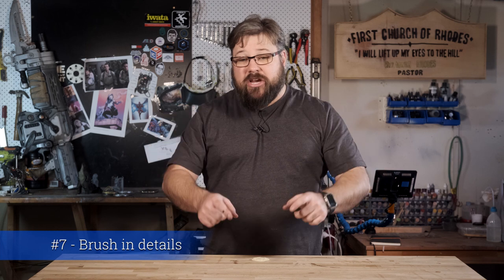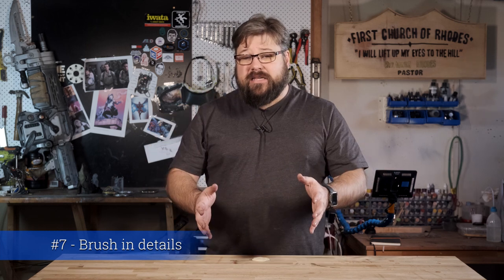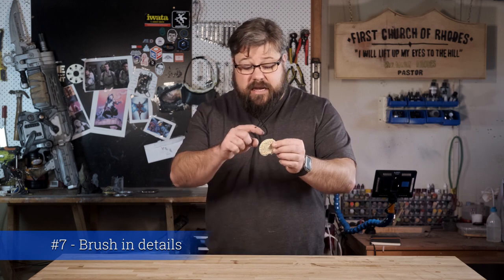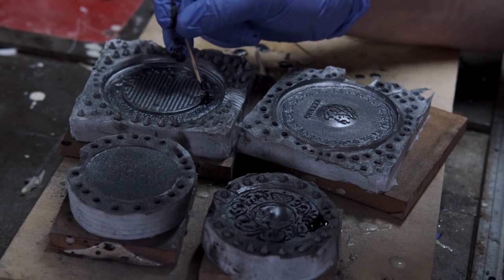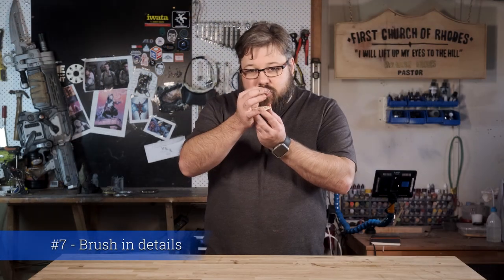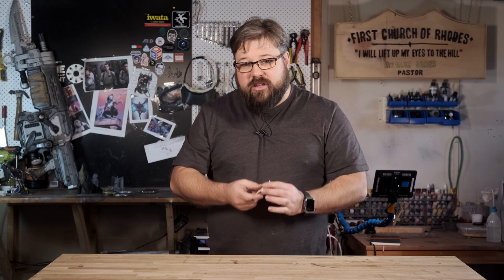Tip number seven is brush in your undercuts and rotate during filling. I had a heap of casts that worked perfectly except for one tiny little air bubble stuck in, say, the hinge portion of the marker or at the bottom. To counter this, I found that dripping a few drops of resin onto the hinge pieces while I was degassing the rest of the resin allowed me to use a toothpick to push the bubbles out manually during pouring. That made a huge difference.